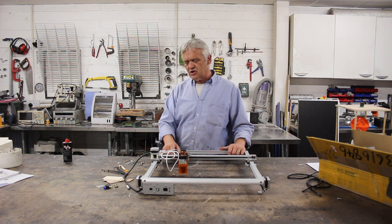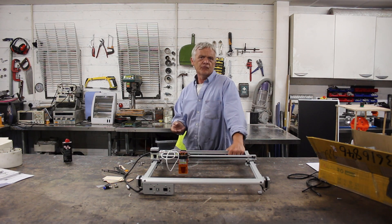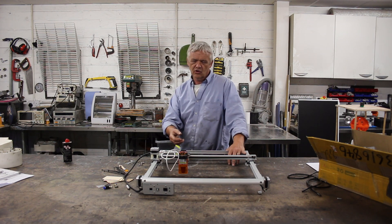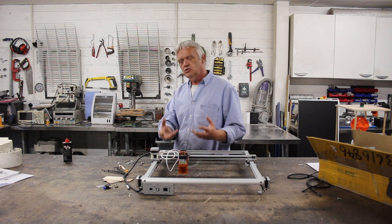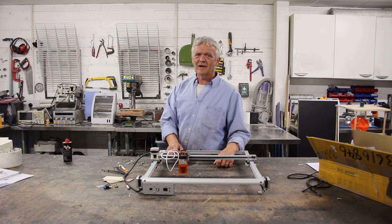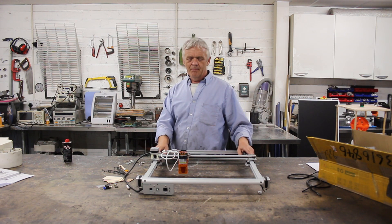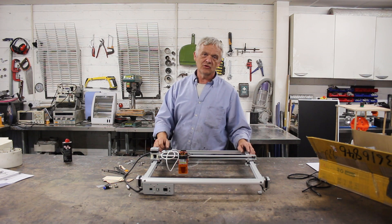So we've got ourselves a laser engraver cutting machine. This machine costs about $266, which is not fantastically expensive — the Chinese CO2 laser cost about £300-£350. This is cheaper, which we'd expect as things get more electronically controlled. With this, if you get a fault it's going to be in the laser head, and because of its modular design, it's much easier to replace everything. I was having trouble with the mirrors and lensing system on my CO2, and the CO2 laser itself actually went — a new laser is about £70-£80. Mending a CO2 laser really meant you needed to know your stuff and have room. With these machines you're more focused on the artwork and less on the technical detail, which is great.